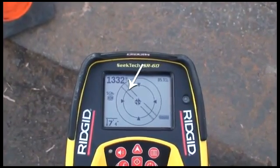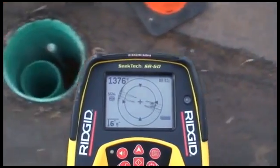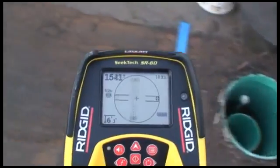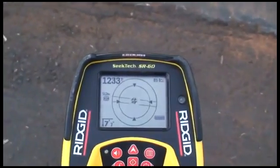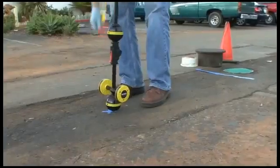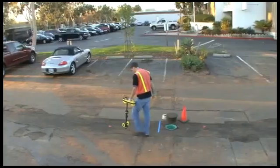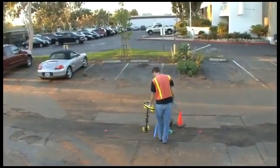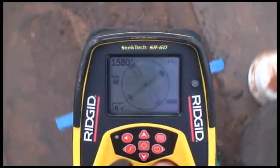We know the second pole is on the far side of the transmitter, so we'll move toward it along this line. We'll pass over the equator, and then we'll come to the second pole. We'll center it on the crosshair and mark its position. Now we'll line the receiver up between the 2 poles and head back toward the equator. We'll center the equator to finish mapping its position,